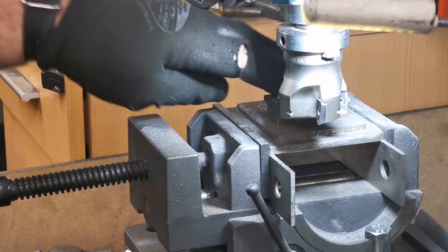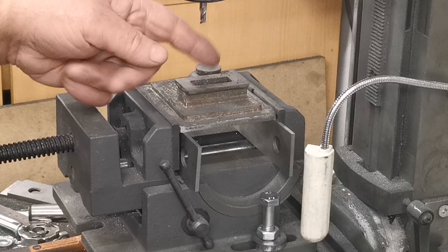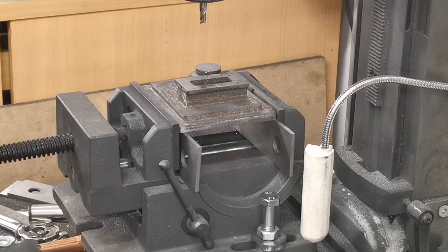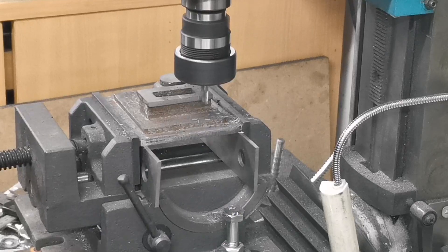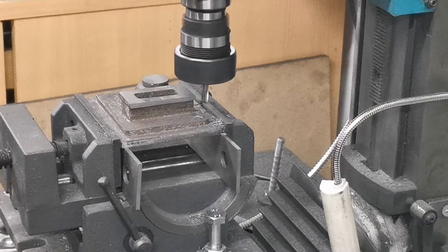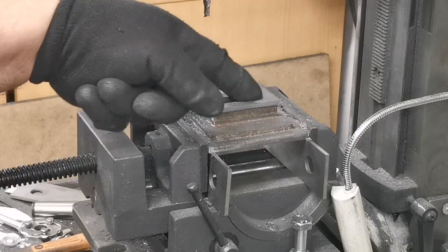Next I'll have a look at the drawing and see what I've got to do to the tops of them. What I've got to do now is widen that slot in there a little bit, equally each way, and then make the sides of this parallel, and then clean up the ends of this part. That's one side done, I'll just do the other side. That's both sides of that part done, now I'll clean up the ends and then widen that slot a little bit.